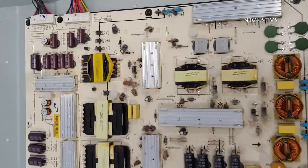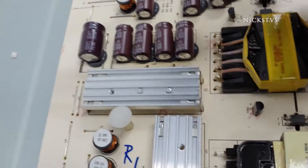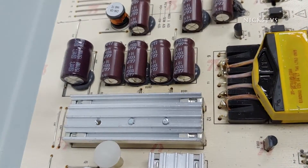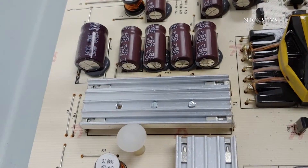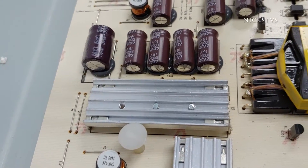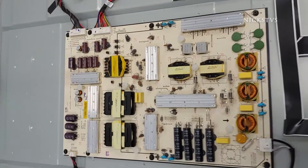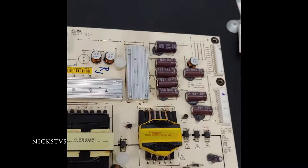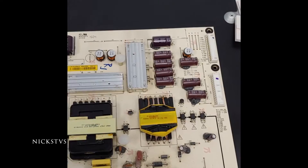We want to make sure there are no issues with the power supply like burnt components or bulged capacitors. On this one it is actually fairly well known that it does have bulged capacitors up here on the top right. You'll notice we have one, two, three, four capacitors over here, and the tops of them are a little rounded out, whereas a good capacitor would be nice and flat at the top. So these four capacitors are damaged — they're bulged and need to be replaced. We're also going to replace the three over here because we have seen those go bad too.